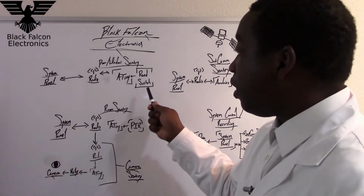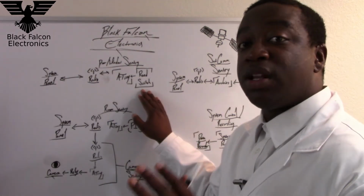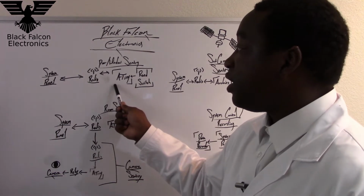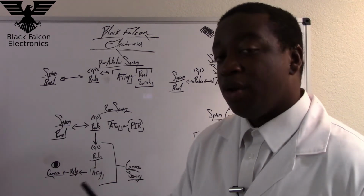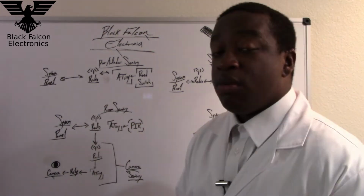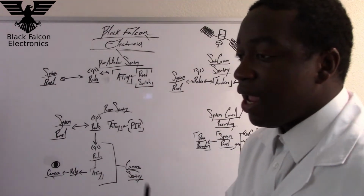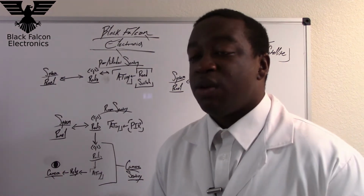So all you have to do is on every door and window, put a reed switch on it so that when the opposite state happens from the one it is in when it's closed, it will send a signal using an ATtiny, and that ATtiny will receive that information. It will do a digital read and detect that there is voltage or that there isn't voltage, depending on the type, normally open or normally closed. And then it sends that information to a radio. Now that radio will then send a signal to the system panel telling it that a door or a window has been opened. But it will do more than just say, hey, a door or window has been opened. It says specifically this specific door or this specific window has been opened.